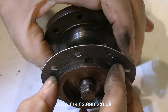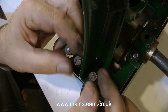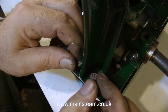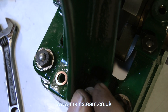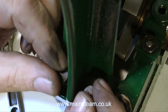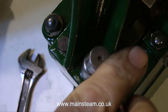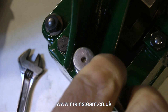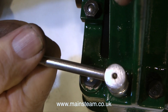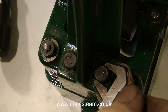To position the gasket on the finished engine it needs to slide over the piston, so I have to compress the piston rings. Now it's time to mount the standard - these ¼-inch BSF bolts were supplied by the customer and I had to shorten them slightly. I'm using the same small copper washers, partly just because I have them and they don't rust. These ¼ BSF nuts have to be quite tight, and I'm using a socket to get a good purchase where there's no room for any spanner. I will finally tighten them up with my adjustable spanner, being very careful not to round the edges of the bolts or damage the paint.